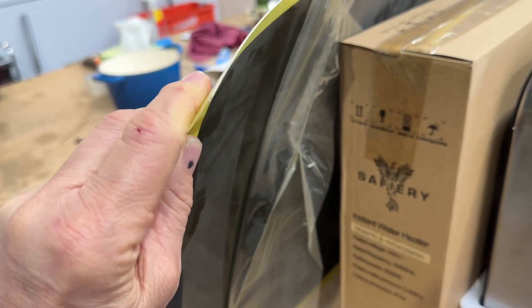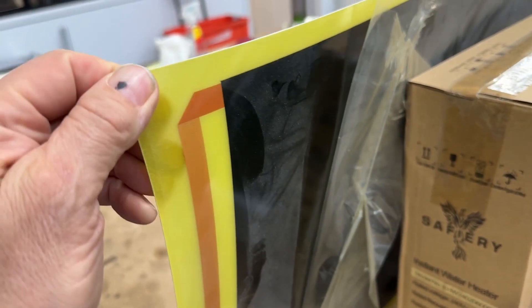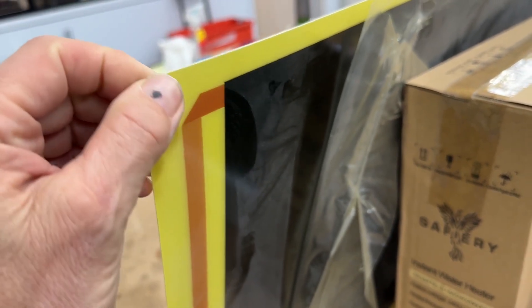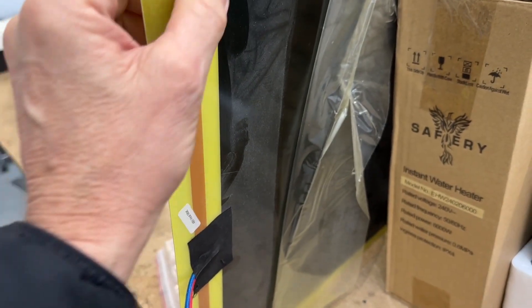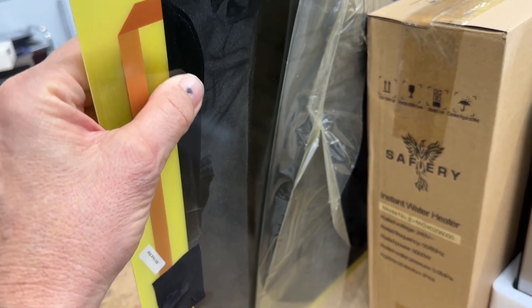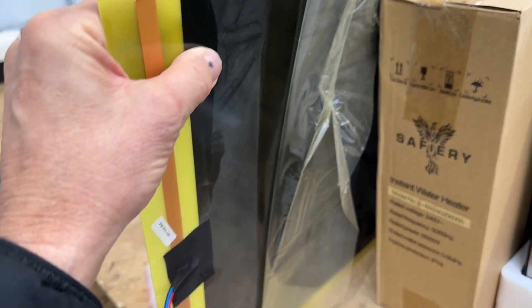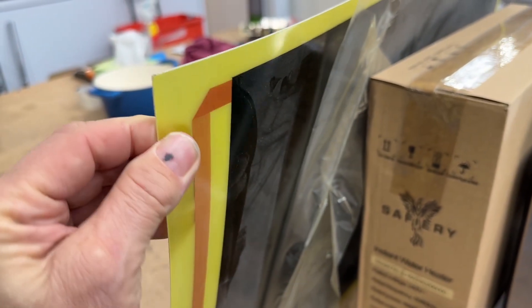This last item here is the luxury underfloor heater. I've got to show you this because this is my design. This is fibreglass here, 0.6mm thin, and there's a cathode and anode in there. Then this is a very secret source way that we put this carbon dielectric down, and that runs at about 123 watts. You can stand on that with stilettos — you can see how thin it is — and you put that underneath.